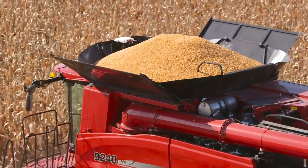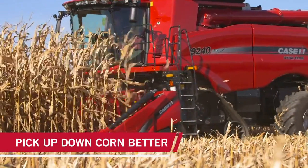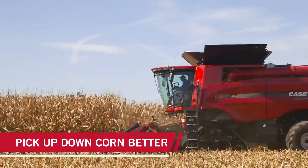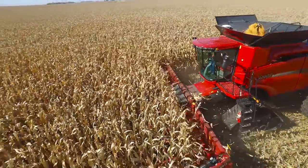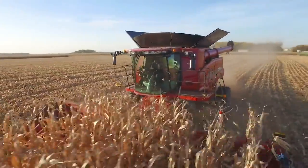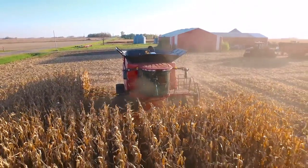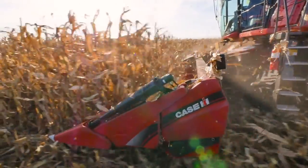Two years ago we had such a great year that the corn actually started to cannibalize itself and tipped over. Last year we didn't see that but we had some bad wind storms that made it gooseneck a little bit and break the tops off. With the other corn head we used before, you would have to get out and push everything into the center. But with this corn head, the way they have those gathering chains positioned, it pulls it back into the auger bed a lot smoother so you don't get anything to hang up and you don't have to pick at an angle to try and get it to feed in.